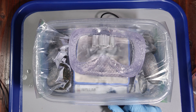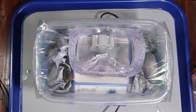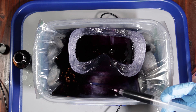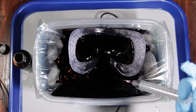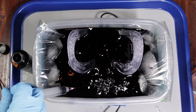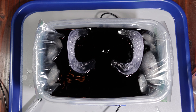The only tub I had handy that was big enough for the mask was pretty large, so I put in some rocks and ziplock bags to take up volume in the dye mix — this lets me use a lot less IPA and dye to get the job done. One thing that's kind of annoying about this process is that it generates more waste than I'd like, since parts from a resin printer are soaked in IPA to clean off excess uncured resin and I can't reuse IPA that has dye mixed in. I'll store the premixed black dye IPA in a jug and hopefully get another use or two out of it. I'm also putting in a piece of scrap aluminum under the front of the mask to level it out in the tub, making the fade detail parallel to the front face once it's done soaking. Otherwise I'm doing exactly what I did before: mixing in 2% dye, turning on the magnetic stirrer, and letting it sit for around 15 minutes, then pulling it out to air dry and popping it in the UV cure box for final finishing.